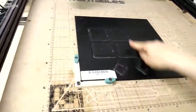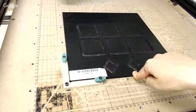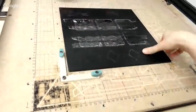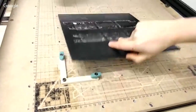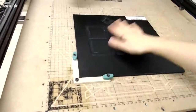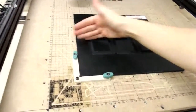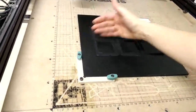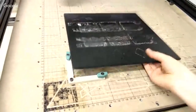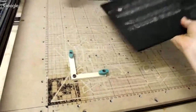Now the reason it's important I flip it left to right is because remember I've lined everything up down the vertical center of my material, which means if I were to flip it front to back, it really doesn't do me any good because I've not lined up all my shapes to flip along this axis. I've only lined up this particular Easel file to flip this way.